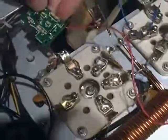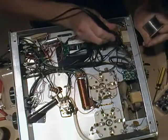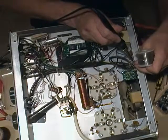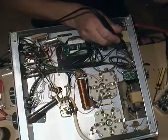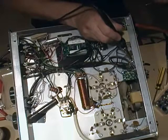Here's where we're at now — I've got that nylon post on there. When we put this board on, the board has one hole for the nylon post, which is basically a nylon standoff. It's important — you can see the voltage regulator right there. The instructions specifically state they want that on the opposite side of the fan cutout. Be a little careful around all these other wires so you don't melt any insulation. The solder will work its way down into that braiding — you want to make sure it's not just shiny on the surface, but that it works into that braiding. Take your time and get a good solder.